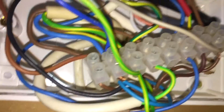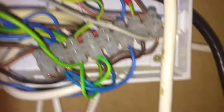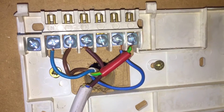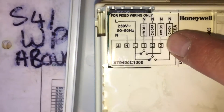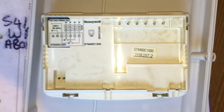This is how I always start - the easy way to check your wiring is correct. I can see that blue wire there goes up into number three on the programmer. The blue one going into number three is hot water on. So this wasn't sending out power when it should have been. We've got a few issues here, but this is the one that's causing no hot water - it's the programmer.